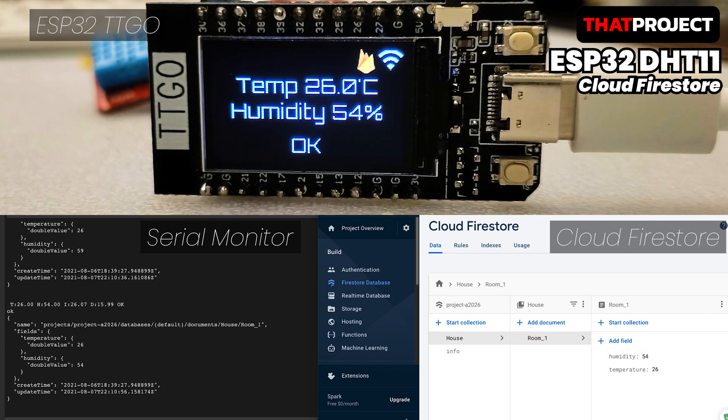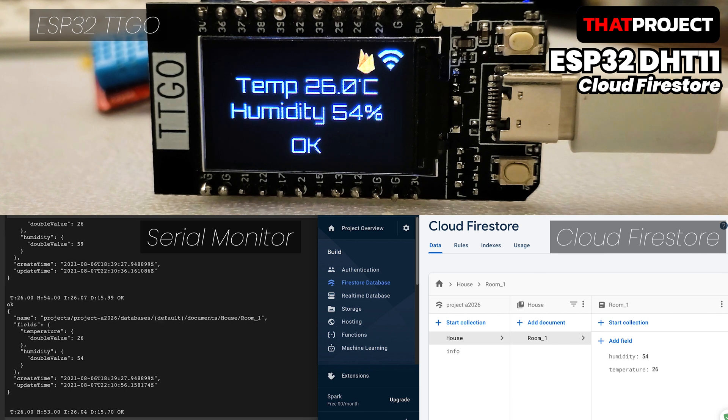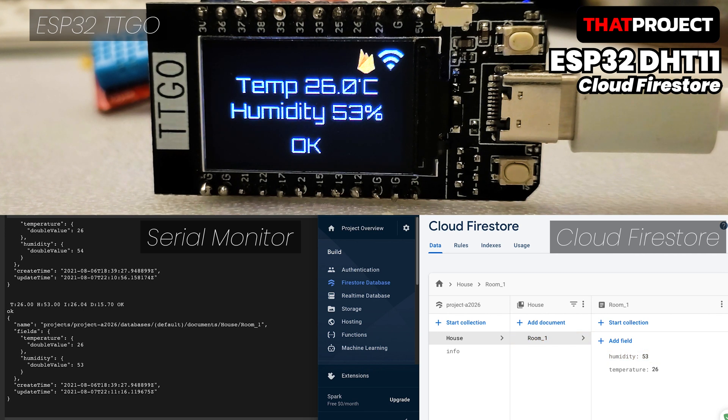In this video, we're gonna prepare the input source first. Let me connect ESP32 TTGO and DHT11 to output information about the current temperature and humidity on the 1.14-inch screen. I'll talk about Firebase in the next video. If you don't need this part, please move on to the next — I don't wanna waste your time. This project is a series project and it even creates a mobile application for Firebase. Let me show you how to design and implement the entire system. Let's make it together from scratch.